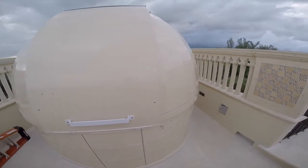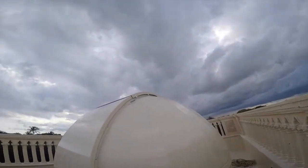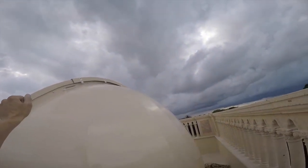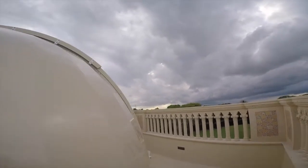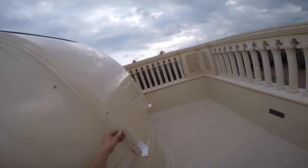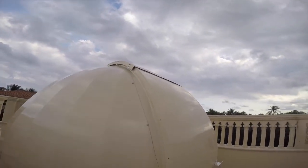Leave the key there or take it out — your choice. Out here on the side, you see this steel cable — that is a shutter restraint system. It's meant so that when the dome is fully open and high winds come along unexpectedly, the shutters don't blow away. It's loose; it's not meant to hold the shutter down during a hurricane. It's just meant to keep it from blowing away if we're using the dome and winds come along.